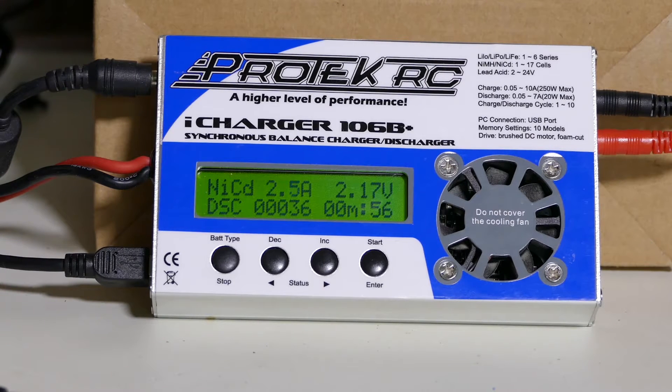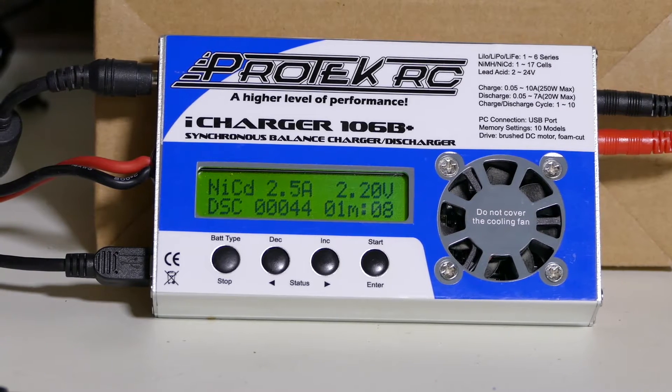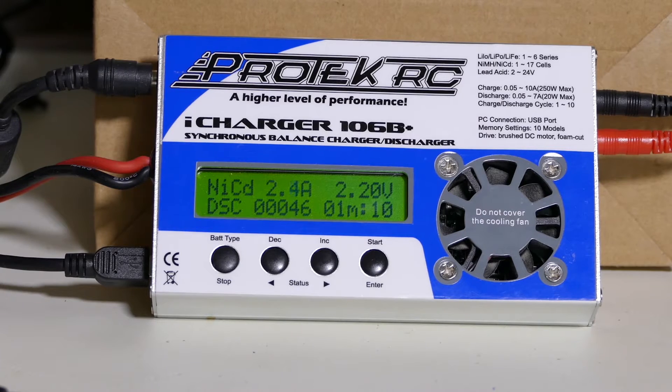I would think basically that the balancing is going to work out a lot better, so that's what we're going to do next — we're going to do balancing and see if that balances properly. I'm not going to charge it through the lithium settings this time, it takes way too long. After this discharge we're going to charge it up, do a quick charge, stop it around 4.1 volts, and then connect the balancing lead.